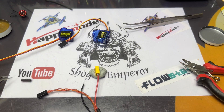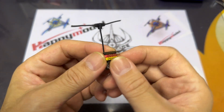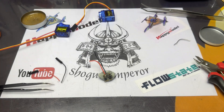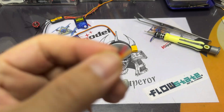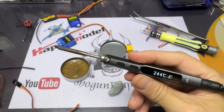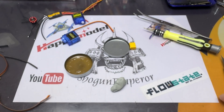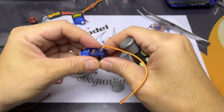For the receiver I'm using the EPW5 ELRS — a five-channel receiver — and I'm connecting the servos, motors, and camera onto it. Just so you know, if you ever encounter enamel wire on your ESCs or motors, you need to increase the temperature of your soldering iron to about 400 degrees. That will melt off the enamel from the wire. It will burn the solder a little, but if you're just tinning the wires for soldering purposes, a short while is fine — just don't breathe the fumes.